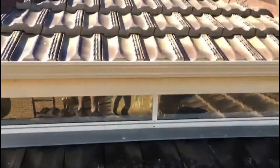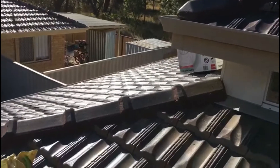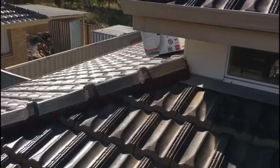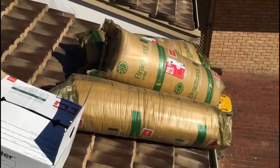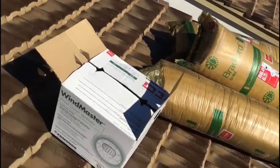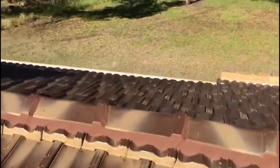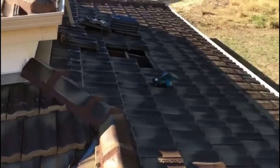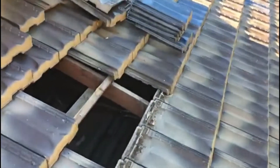It's a very tight little roof, as you can see up here — very, very tight. Going to throw some whirlybirds over this side because that's a rake ceiling, there's no actual ceiling space in there. But once we drop these R6s in — as you can see, these are the top of the range, best in the Australian market at the moment — they're Bradfords, so they are the best. Got a heap of bags to go in. It's only a small roof, very tight, that's why we're going straight for the top of the range. No point wasting our time with R4s or R5s.